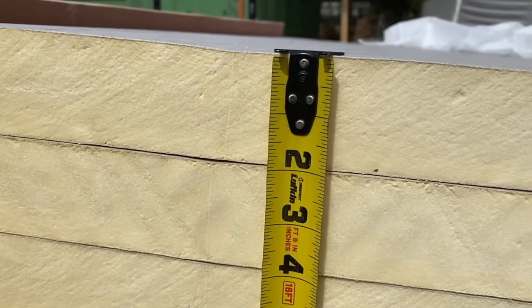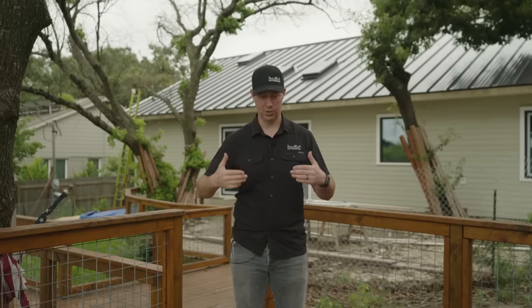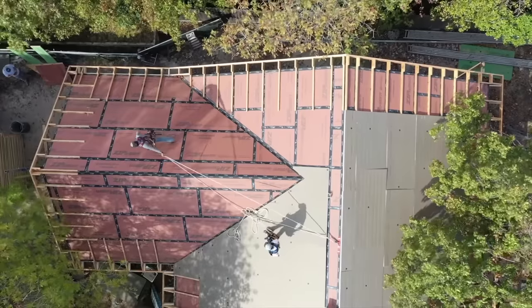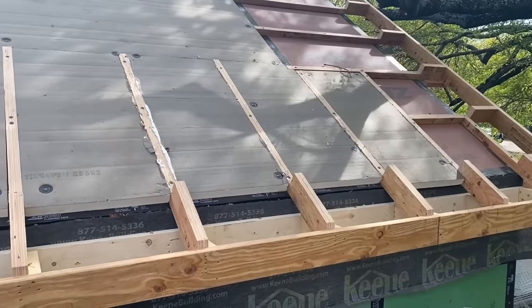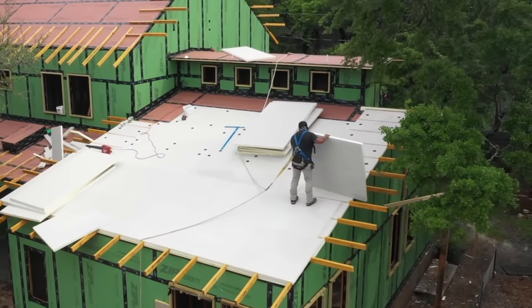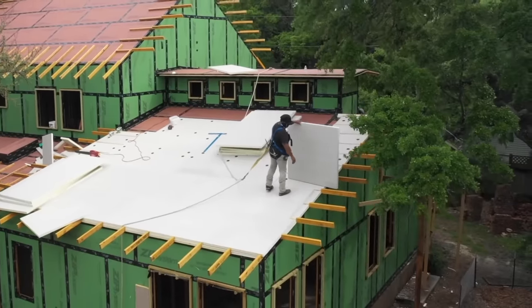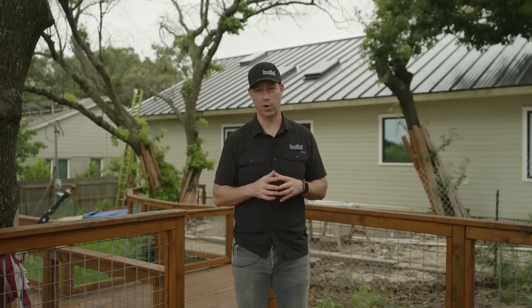Thinning down to two inches lets me put a second layer of poly iso on top. Once those were down and the overhangs were formed on the outside, it kind of looks like a toothed exterior from the drone shots — that's only to form the overhang. We used Atlas Poly Iso with a fiberglass-faced product, which is around R5.5 per inch. With four total inches of depth, we got to around R21 for the rooftop insulation.